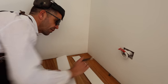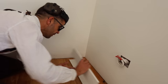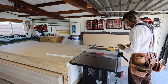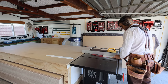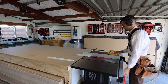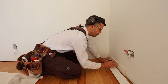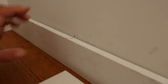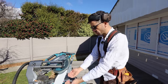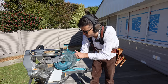What I did there was I marked the top of the skirting — the long skirting — and then I dragged that same skirting to the end and marked the top again, so now I've got two marks here. I'm putting this up to it and it's telling me this needs to come down a couple of mil. I mark the wall like that — so I've marked the point and shown myself where the angle is, so on the drop saw we know which angle to cut. Now this is the way I was talking about before: you have the single bevel facing outward so when the blade goes in you get a cleaner cut, and I can do it this time because the bottom is parallel to the top.